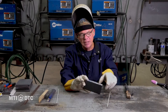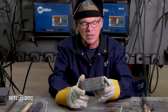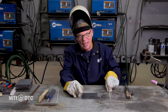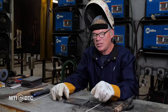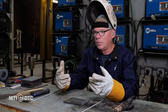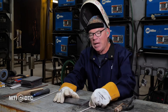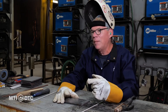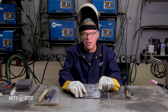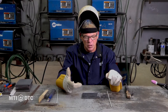We're going to be welding on three-eighths plate today. You can see I've got it all polished up so we don't have a lot of spatter and you can see the weld. For the most part, I wouldn't suggest stick welding anything less than a quarter inch thick. It's just that the 90 amps it takes to burn this is going to burn up your base metal before you actually start doing any welding. Some guys might prove me wrong, but quarter inch would be a little less comfortable, and there are other processes we use on thinner steel. So we've got some three-eighths carbon steel plate and we'll get to it.